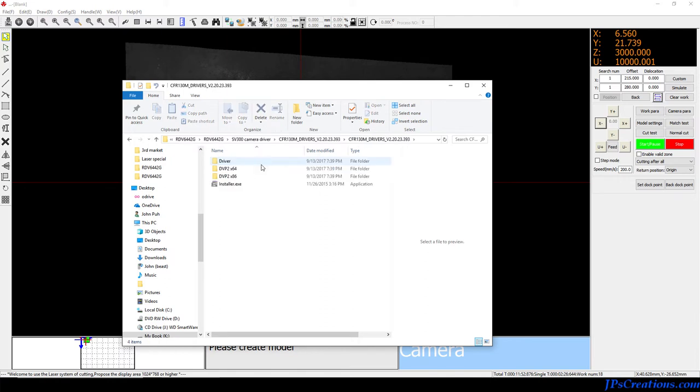If you think, oh, I have an X64 system because it's 64-bit, I'll install the 64-bit version — nay, nay. The camera requires the 32-bit version to actually work. And if you install the 64-bit version, it won't let you install the 32-bit version, and there's no uninstaller package. So I either had to restore from a previous backup, which I really did not want to do, or find a way to uninstall it.